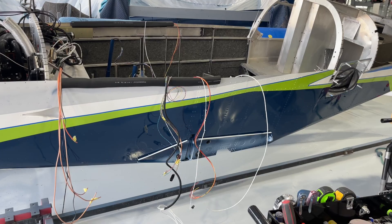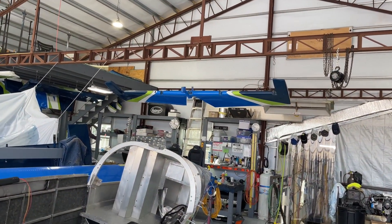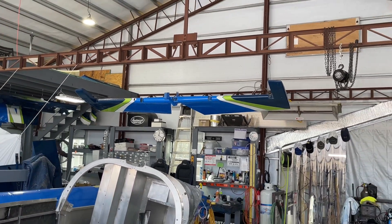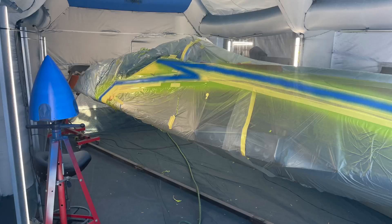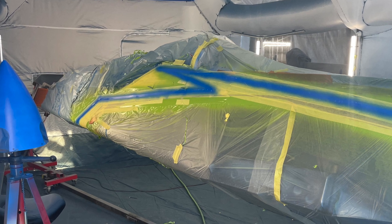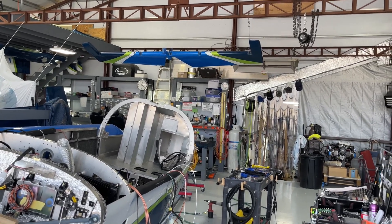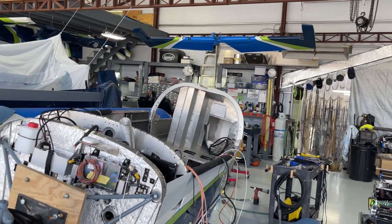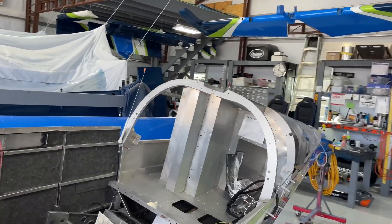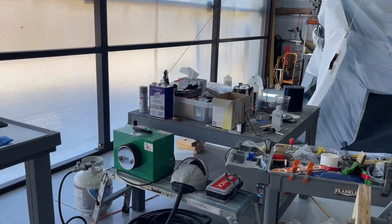Getting the lines established takes a little bit of time to make sure they're exactly where you want them and symmetrical on both sides of whatever you're painting. If you're painting the elevator, it has to be symmetrical on both sides. Then you mask off for one color — it only takes 45 minutes to paint but could take a day or two days to mask. Then that color dries, you pull that mask off, and remask for the next color and the next.